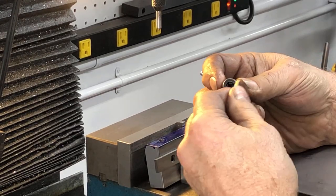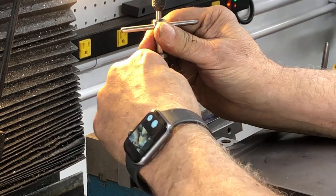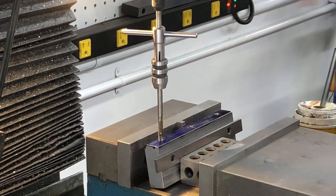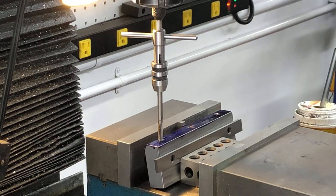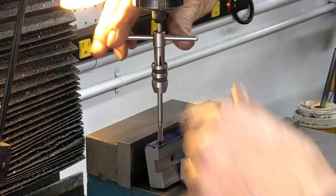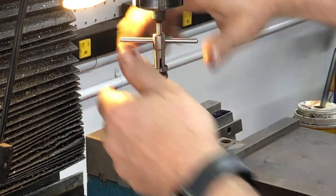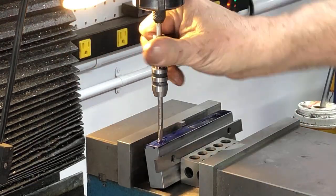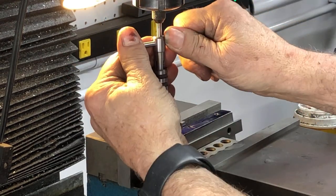So put that in a little T-handle. Lift it up, set it in. Sauce for the goose. Make sure you find the hole, find the threads with that tap, because if you're not paying attention, you'll grab halfway in and cross thread another set of threads. Okay, so I just hit the bottom, kind of where it's not cut yet. Listen to my mill squeak while I wiggle it. Okay, there's the bottom.